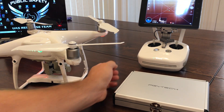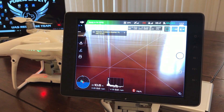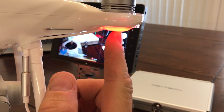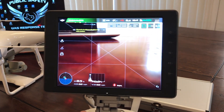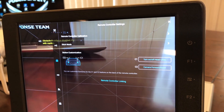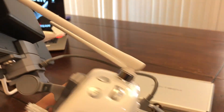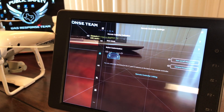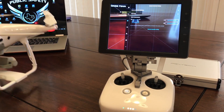The instructions tell you to set up your C1 and C2 buttons, particularly to turn the lights on and off. The way this is mechanized: there is a light sensor up in the lens area, and whenever you turn off the front LEDs it sends a message which triggers the release mechanism. I have my C1 button set to turn the head LEDs on and off. Whenever I press it, it turns them on and off and actuates the release mechanism — both on and off will trigger a release.